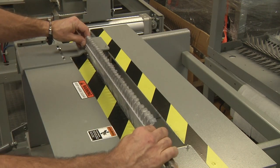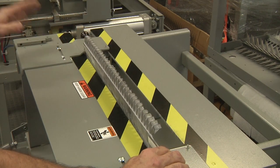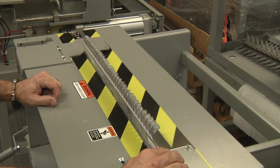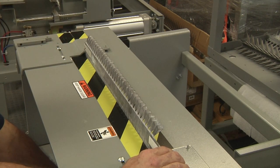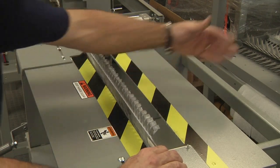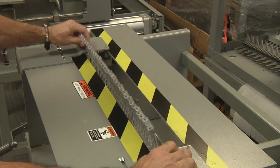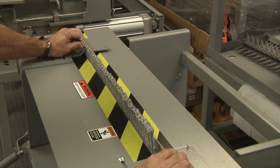You put your rack in there — that's loaded with parts. Instead of using the handle to put it down, since it's closer, you just push the foot pedal. The fingers are squeezed and the parts drop into a canister or however you want to configure it underneath the machine. Then you let the foot pedal go, and it doesn't go all the way back — it stays in the unracked position. You flip your rack over, push the foot pedal, and it unracks the other side.